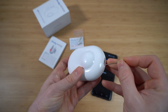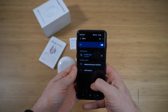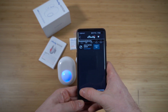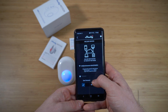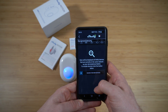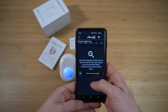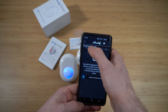Setup is pretty straightforward using the Shelly app. Using a pin included in the box, press the little button on the bottom left of the micro USB port for 10 seconds and it will begin to flash. Connect your phone to the motion sensor's hotspot and open the Shelly app to complete the process. Pretty simple stuff. I did find the app a little clunky, with some UI elements appearing in strange places or overlapping each other, but all very minor and hopefully fixable with future updates.